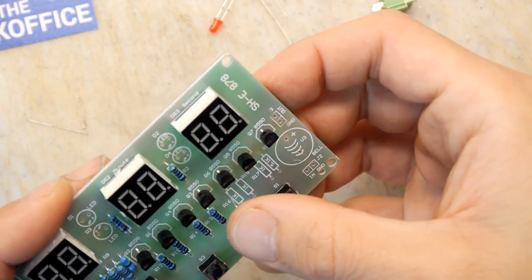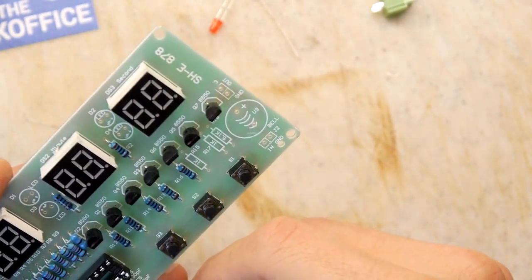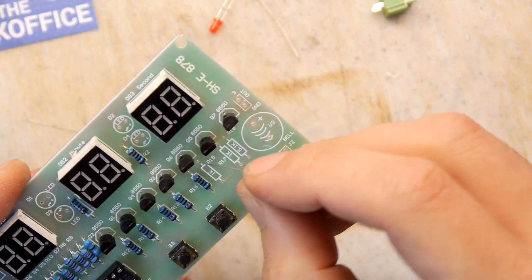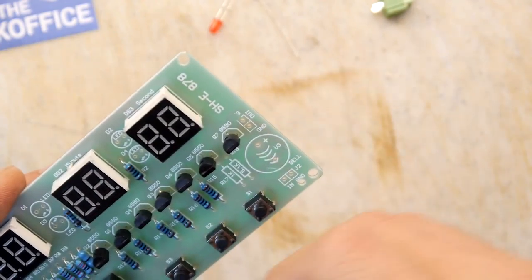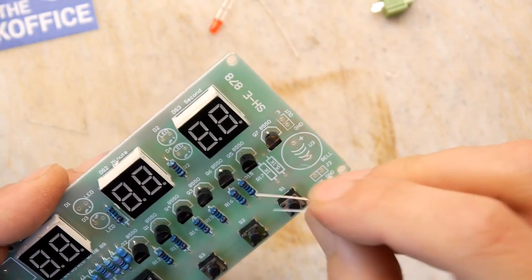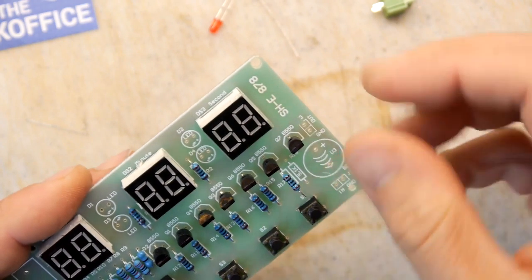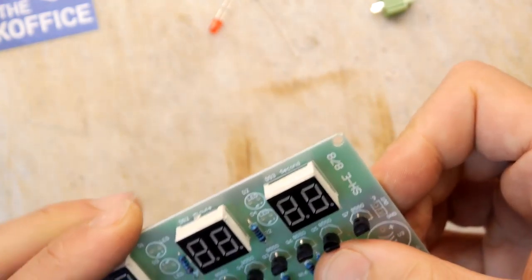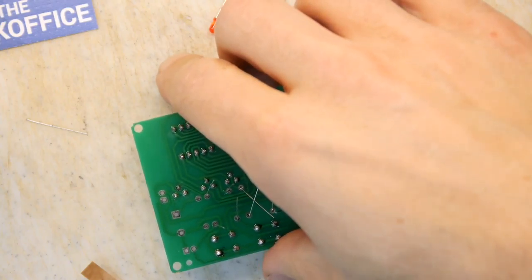Come on, almost there. These are the worst, but we're nearly there. Although, probably what's worse is trying to figure out what the last two resistors are in terms of their values, because I really don't like doing that. There's only a 10K and a 5.1K left, so I'll just have to buzz only one of those out with my multimeter, and we'll be golden. Right, very gingerly turning it over.